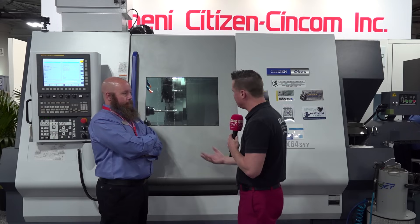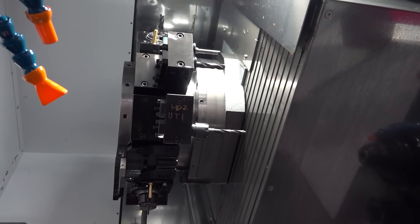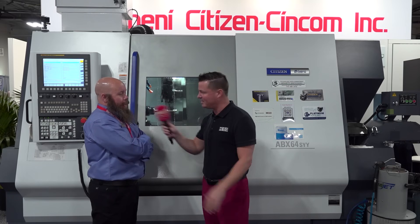When we hear the word box way, let's talk to the audience — what does that actually mean, and what does that added rigidity give? It's a simpler setup with more surface area contact, whereas when you have a linear guideway, there are ball bearings and more moving components. And Bailey, are we doing hand scraping on this machine too, to go along with that rigidity?